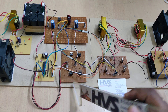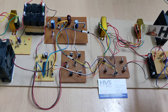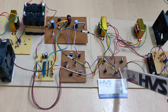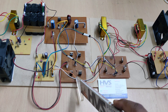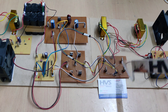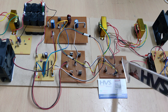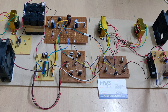From the H-bridge circuits the signal goes to the transformer, where we are using a high frequency 1-to-1 transformer. The output of the transformer is given to the H-bridge circuits, which will act as a rectifier — converting DC to AC, passing through the 1-to-1 high frequency transformer, and then another H-bridge circuit converts the AC back to DC. From there the output is given to the load and in parallel to the battery.